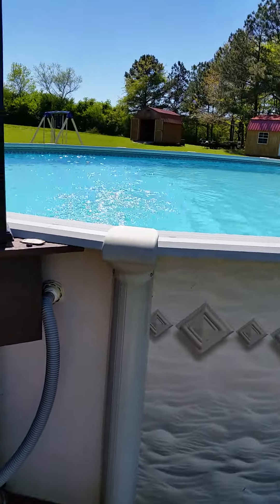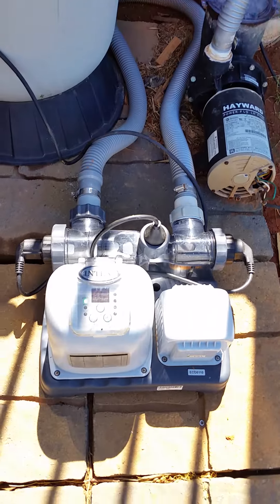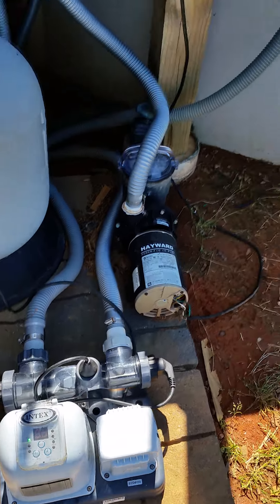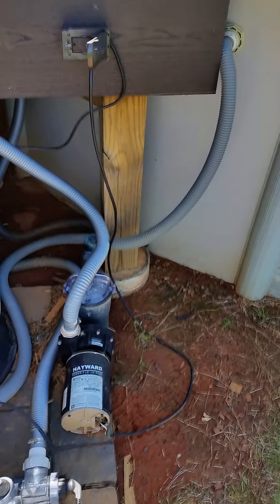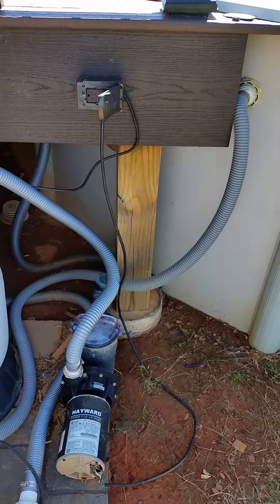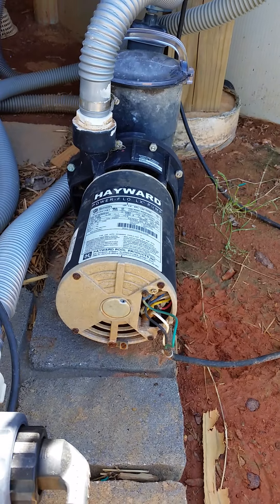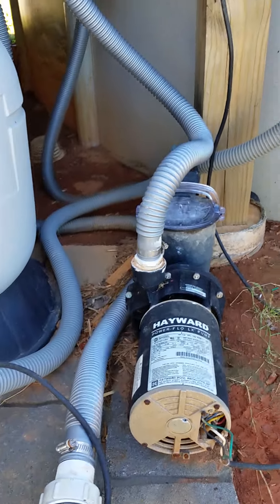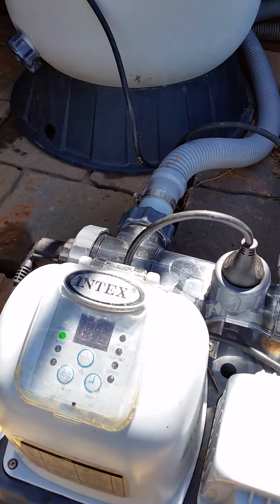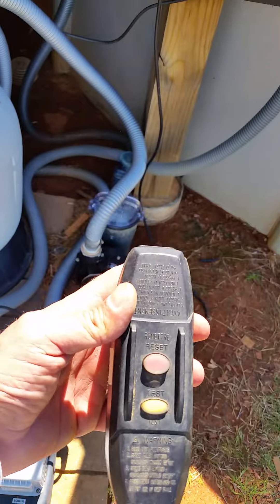All right guys, it's that time of year again, got to get our pool back in order. It's been sitting all winter. I'll show you a problem I ran into today that might help everyone out. When you go to start up your pump — I have a Hayward pump and a Hayward filter — the pump did not want to stay running, did not want to fire up at all. That's because water got up inside there, and if it gets wet in there it's not gonna run, it's gonna short out and keep tripping a circuit breaker.